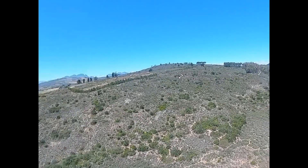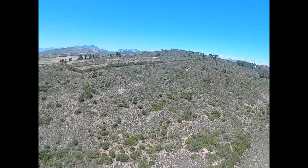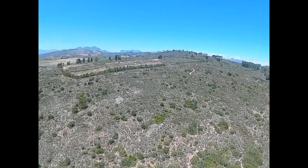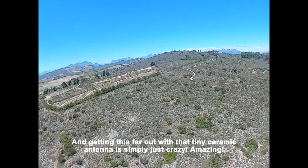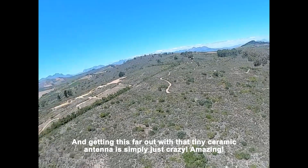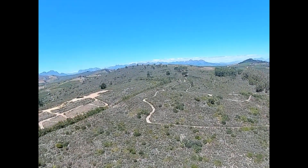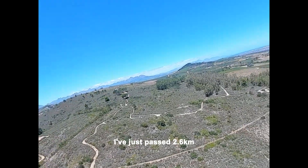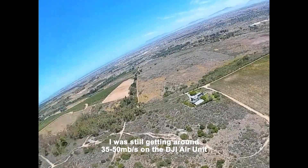But this is the first time I'm sending out an EP2 this far, and I was very curious because everyone says ExpressLRS is fantastic. I wish I had OSD to show you but I don't. The RSSI dBm was sitting at around 94, 95 and then went up to about 99 around here, and I said okay, I'm running at 150 milliwatts, I still have some space, but let's just be safe and head home.